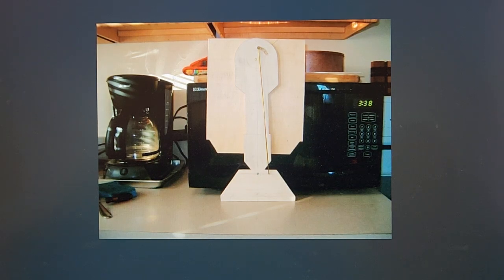So that's when I explained to him: think of the leg as the go-kart, and think of the foot as one of the front wheels, and think of the body as the other front wheel. So if you have a mechanism inside this body that forces this leg back, thusly making the leg-to-body go to an angle, this tie rod in the leg going down to the foot is going to make the foot go at an angle.